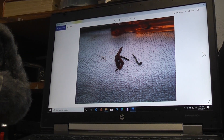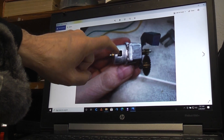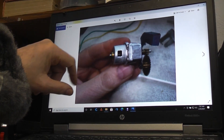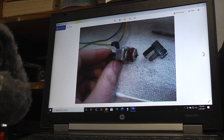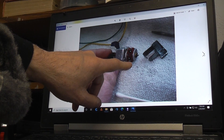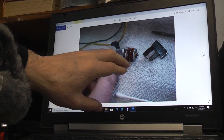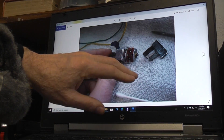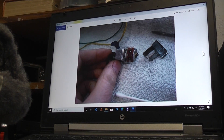Here's a close-up of the cardboard piece — this brush was the worst of the two. Normally it would be fitting in that little slot right there; this one is still sitting in its slot, but the little piece of cardboard it crimps around had given up the ghost. This is a side shot of that square opening. If you're lucky, normally you can just spray some contact cleaner in there, revolve a gear a few times, maybe spray it twice, get everything cleaned up and running again, and while you have the motor accessible you should put a drop of oil on the bearings on both ends. But in this case there was no real way to fix that broken fiberboard piece — I could have tried epoxy or super glue to secure the brush with a new wire soldered to it, but I had a better option.